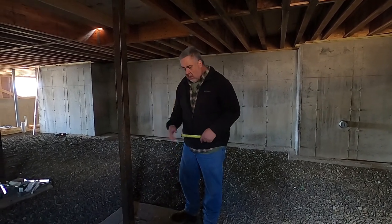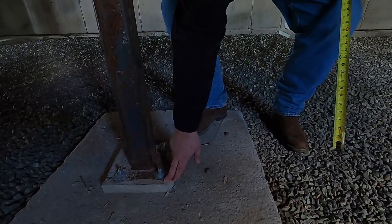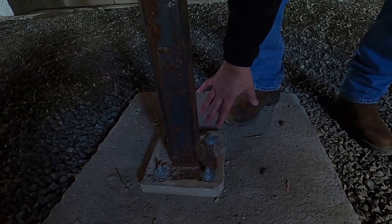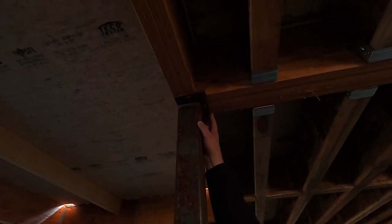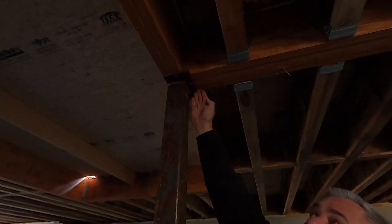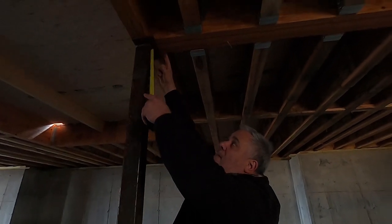What I have here is a three-and-a-half inch steel tube column. It goes down to a solid eight-inch base plate that gets grouted in — we level that off and it gets non-shrink grout. This is all going to get buried inside the basement with control joints around it. That plate allows it to level out, and as you come up, notice we have an increased size in the head plate. In New England we fur down our ceiling to get that three-quarters of an inch, but with this increased head plate size the column picks up the beam going this way and also picks up the beam coming in from the other direction — it all seats nicely on that column.